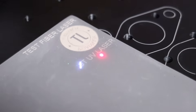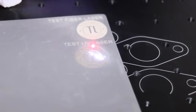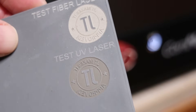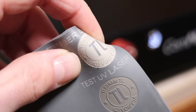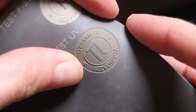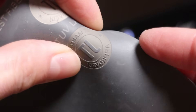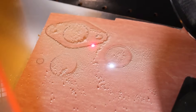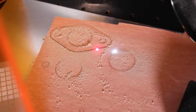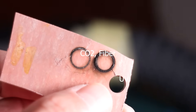The UV laser shows a clear advantage here. UV laser can directly ablate the rubber, leaving a crisp engraving retaining all the small details. Both lasers can be used to make deep engravings in rubber for making stamps, but the UV laser produces finer details with minimal heat damage. Also, if you want to cut high-temperature gaskets, UV laser is the only laser that can do it effectively, as high-temperature gaskets can't be cut by heat alone.